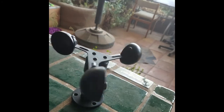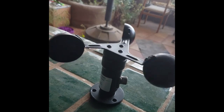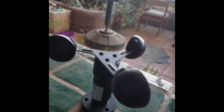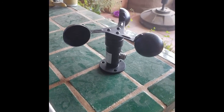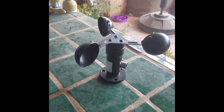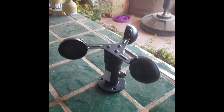The other thing I wanted to do — because it is windy here and this is right up on the berm — is get the wind sensor. The panel will actually set itself flat in high winds if it has the wind sensor, which helps present the smallest profile to the wind and protect it. Unfortunately, the manufacturer that sent me the wrong manual for this tracker also gave me the wrong link to purchase the wind sensor.